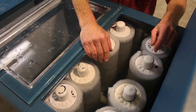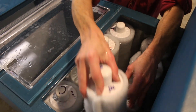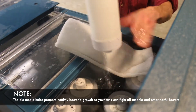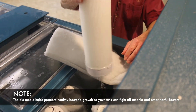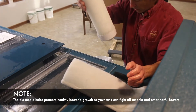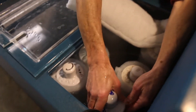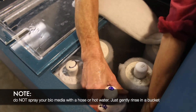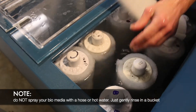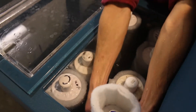The bio filter cells you don't have to clean weekly. Occasionally you can remove the bio filter cell, shake it up to loosen the organic matter that's in it, then wring it out in your bucket of water, put it back in the tank, put your sleeve back on, and you are done cleaning your filter cells.